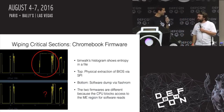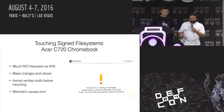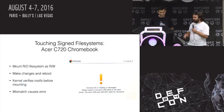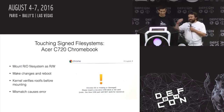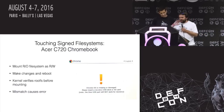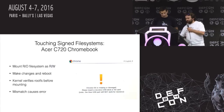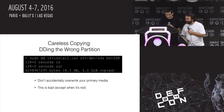So you get a software dump, it's different from your hardware dump, and you flash it back via hardware and you bricked it. The lesson: if you can get hardware access to get code out, that's probably the safer thing to do. If you happen to have a backup before you mess up — another Chromebook example: you can mount the read-only filesystem as read-write, make changes, and reboot. But the kernel verifies the root filesystem before it mounts it, and if it doesn't match, you get: 'Chrome OS is missing or damaged. Please insert a recovery USB stick or SD card.' Backup, backup, backup before you tinker.